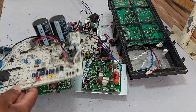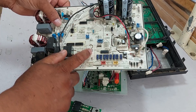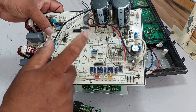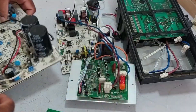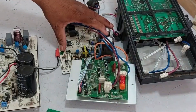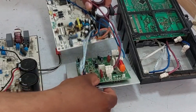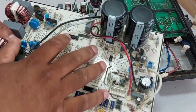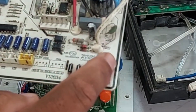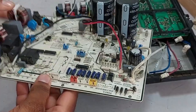I've explained this in a couple of previous videos as well. As you can see, this PCB is used in both 1.5-ton and 2-ton units. In this PCB, we can directly check its power circuit, whereas with other PCBs, I'm testing it by connecting it with the IPM board. The power PCB has a separate bridge rectifier and capacitor for its SMPS so that the power supply works within this PCB.